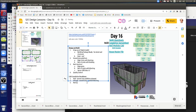So roof. So Wes is doing that. Let's do the roof blocking. Somebody take that. Roof blocking for Prince? Yeah. Okay. Who wants to do the 4-inch rise, which means the 2x4s plus the 1/2-inch plywood? What we showed from the side profile.